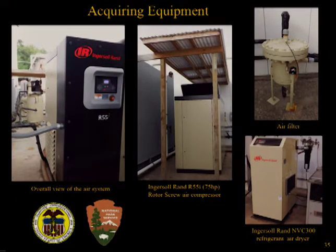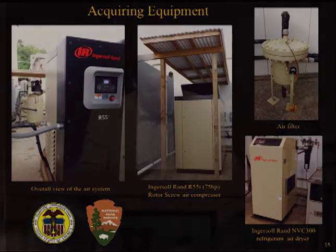Up to this point in the project, the museum had been renting the air dryer and compressor systems, with Cold Jet graciously lending their blasting equipment for testing. Moving forward, the department made the decision to purchase all required machinery through funds received in part from a National Maritime Heritage Grant from the Maritime Administration, overseen by the National Park Service. After conducting additional research into compressors and dryer systems and conversations with Cold Jet staff on the operating requirements of the SDS-60, the conservation team selected a permanently fixed system. The system includes a main compressor with an oil separator, a dryer, and a large holding tank of air to serve a secondary facility approximately 150 to 200 feet away, providing a reserve supply to maintain adequate volume over that distance.